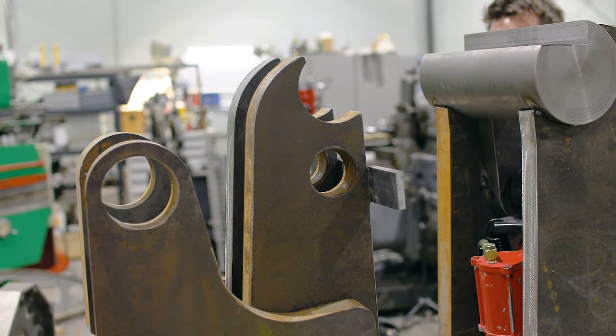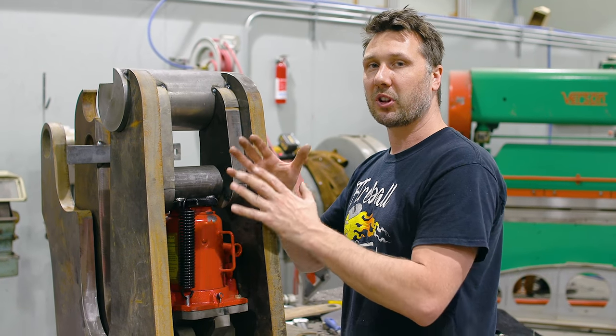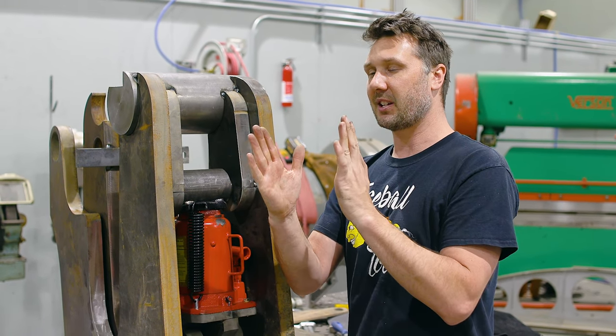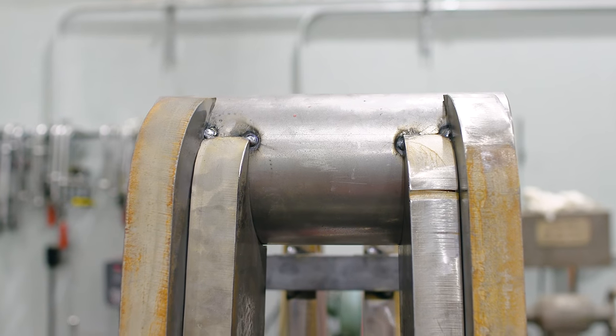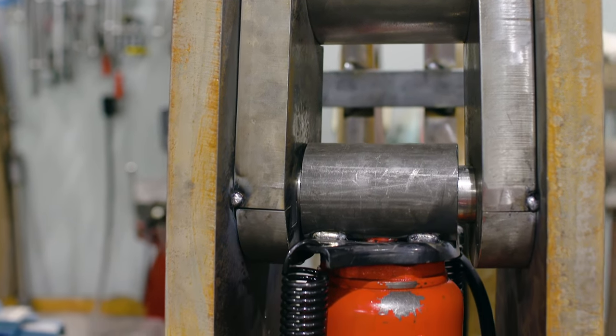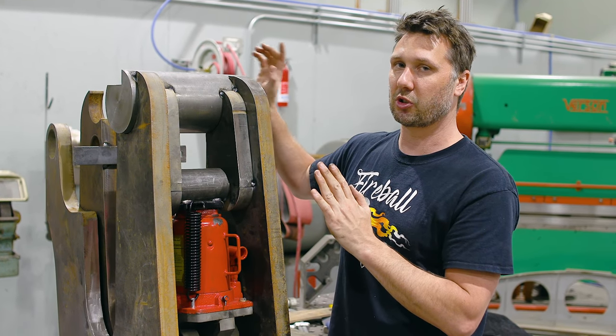and it opens up. So what is the overall design intent for this jack? Well, it's not to move long distances with the arm. It's to give that last little bit of movement and to really increase the power. We're not gonna be looking to move the jaw from its furthest open position and all the way closed. We will do that with a screw a little bit later.